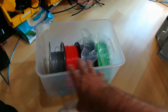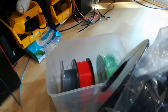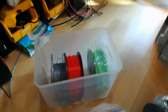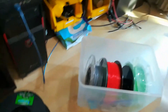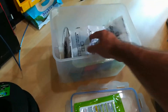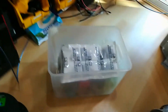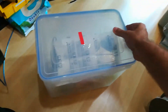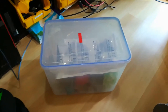Then you come back and only half your print was done and the printhead was moving around with no material flowing. You really need to treat your material with the care it requires. That brings me to this little plastic bin. I bought it to store material I'd opened but hadn't fully used. Spools still in their shrink wrap are best left that way until you're ready to print. For the others, like this black, I've been storing four spools at a time with a desiccant pack — the kind you see in pill bottles — that absorbs moisture. I bought a couple of packs from a Japanese-style dollar store here in Thailand. Combined with this airtight bin from the local grocery store, I have an airtight package with desiccant inside, which is probably the best way to treat your material.